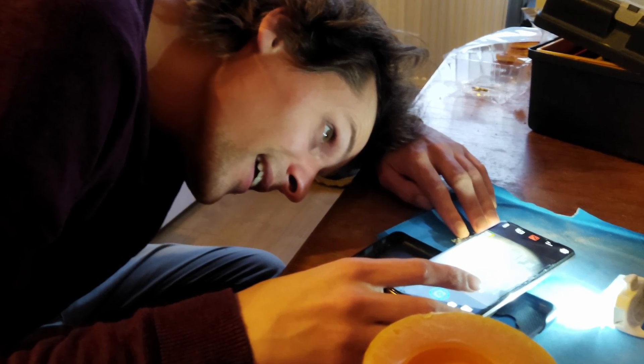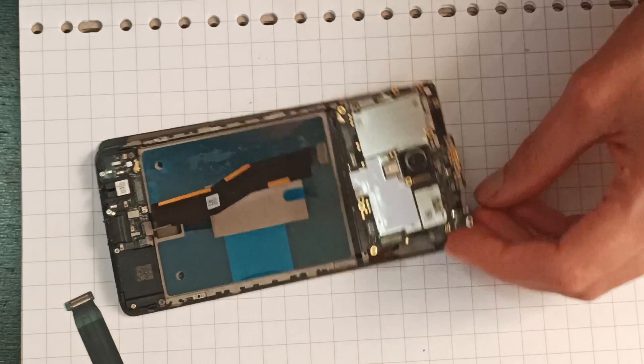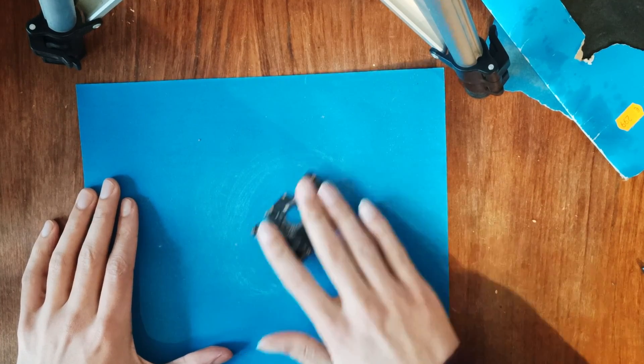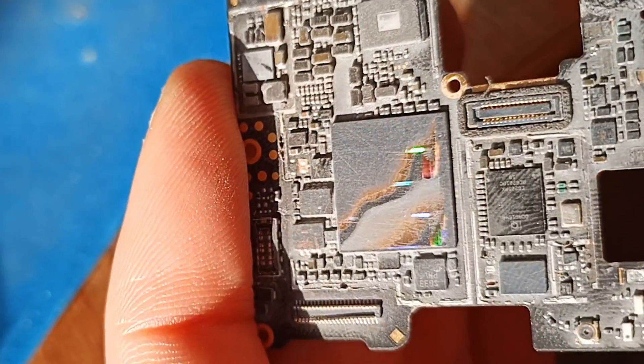Alright, what is this thing? Well, I couldn't quickly find a real picture of the insides of a SAW filter online, so I did what every curious person would do — instead of searching better, I tried to take some pictures myself. I cracked open an old phone I had lying around, taped its camera lens to my current phone to create a DIY microscope, and went to town on the motherboard. First, I tried sanding the whole thing down in the hope I would come across the forks, but after a while I noticed that was not going to work. Eventually, I found the best success by cracking some of the chips open. These chips, of which I was only moderately sure they were SAW filters, kept breaking at the wrong layer — or so I thought, because they just don't look anything like I expected from the theory. Even this one, that has what looks like interlocking forks, has them in all sorts of uneven sizes without symmetry. So eventually I just kind of gave up, because I broke all the filters on the board.